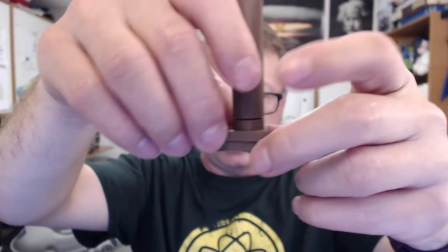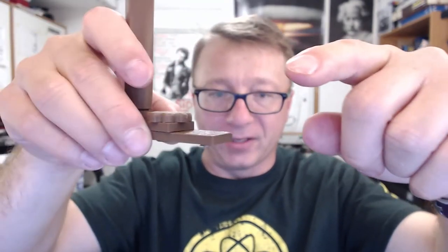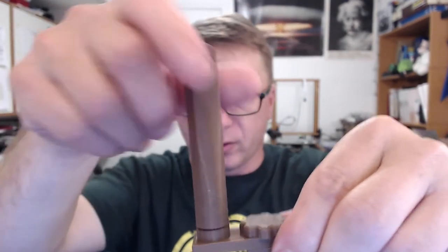So I went on to version two, which is this guy. It's very straightforward — the bolt on the bottom. The way it worked is this guy attaches with the bolt here, and then you can spin it any way that you want. Where the T-slot used to be, it just goes in and locks in, and then you screw the bolt down and that tightens up this joint here. This other joint was free to turn — it turns out that joint was free to turn even when you wanted the camera to stay in place. It was way too loose.